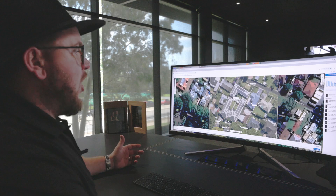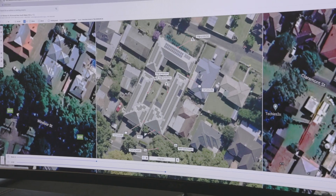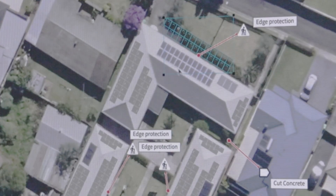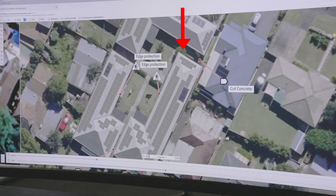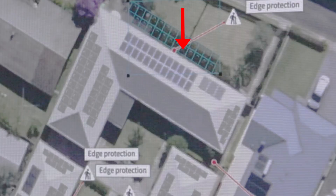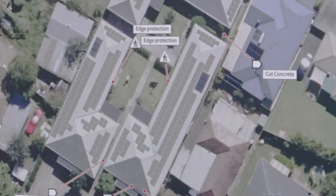This was all made possible by using Enphase IQ8 AC microinverters. You can see up here on the most northern roof that we've removed the existing 6.6 kilowatt string system, which was just not cutting it anymore, and we've installed our new panels over the same real estate. The facility also has three separate hot water systems present on site which are solar boosted, with solar panels on the roof for the hot water system as well, which was another element we had to design around.